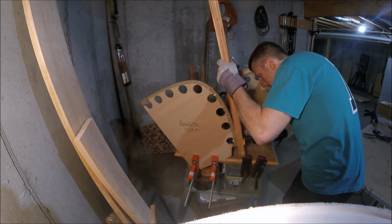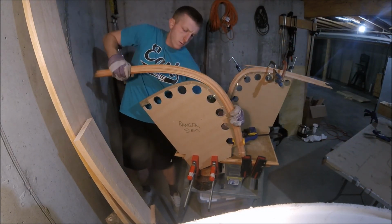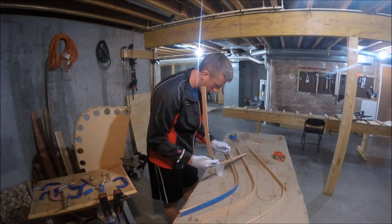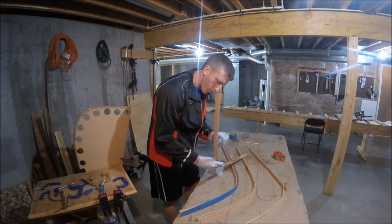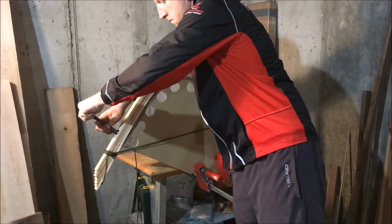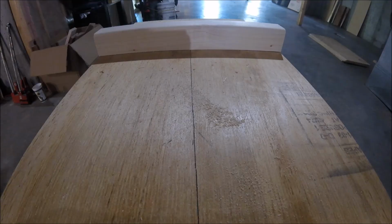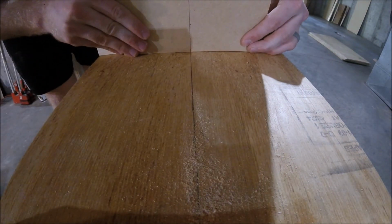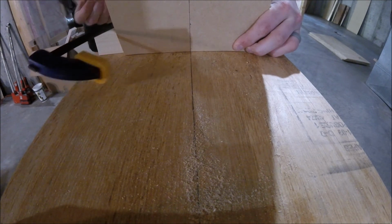If by some chance you've reached this point of the project and have not steam bent your stems, I'd highly recommend you do so before attaching your mold stations. I'll post a link below and at the end of this video of how I glued up my stems. If you've already completed this task, go ahead and grab your last full mold station and place it on your strong back, ensuring that you line up the center line of the mold station with the center line that we marked on our strong back.